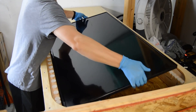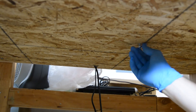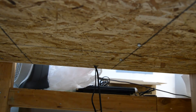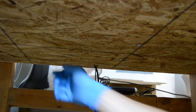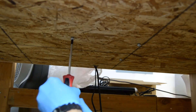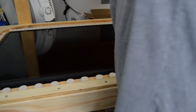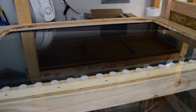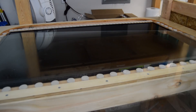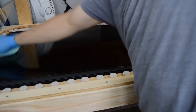I then installed the TV. I connected the power cord and HDMI cable and laid the TV flat inside the desk, wearing gloves to prevent putting fingerprints on the TV screen. Four 2-inch long M6 screws were used to secure the TV inside the desk. With the TV installed, the glass cover was next. I gave it one last quick cleaning so I wouldn't end up with sawdust and fingerprints forever between the TV and the glass. The glass was fairly heavy and if dropped even from a small height onto the TV, it would easily destroy the screen.